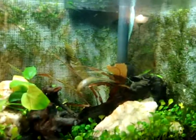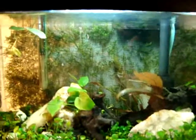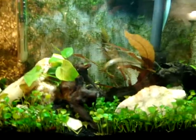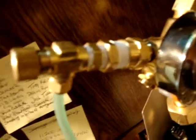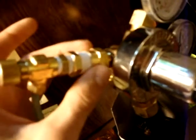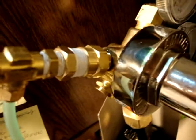I'm still trying to fine tune it but it works. I've got CO2 going from the paintball tank into the tank and not blowing up at all, so I was happy about that. The regulator has a 3/8 diameter connection. I had to bring that down to 1/8 for my needle valve and ended up using two different pieces to get it to work, but it wasn't too bad.